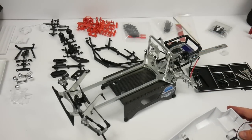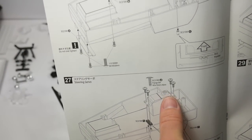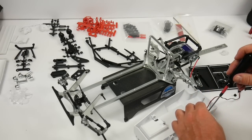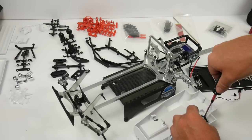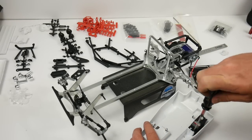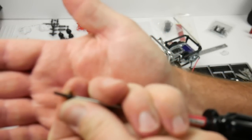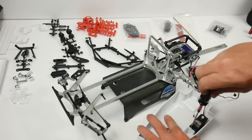I've already checked the orientation of the servo. We're going to screw this thing in and worry about wiring later. Any time I screw in a servo, I like to do a star pattern to make sure everything is even — do one side then switch to the diagonal before tightening everything down. These are nice screws; they're screwing into plastic, but they're coarse-thread, so they go in with minimal effort and stay locked in well. Not the typical fine-thread screws. Kind of coarse thread — nice.